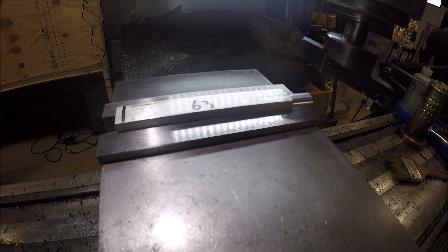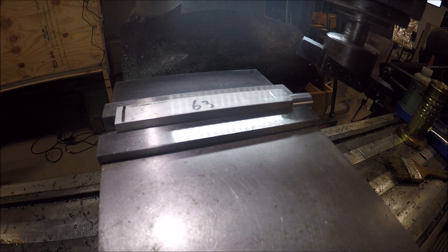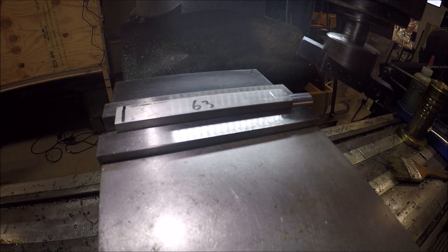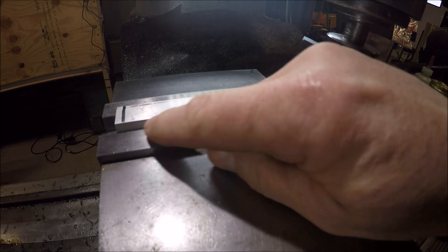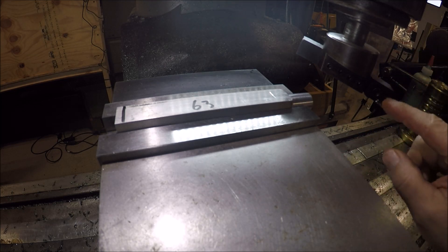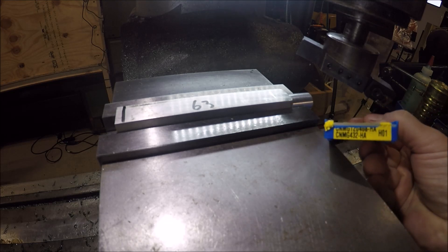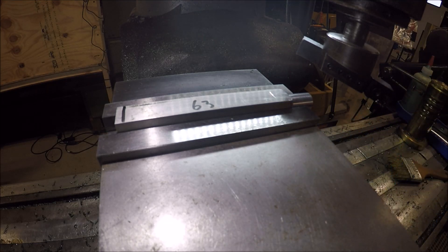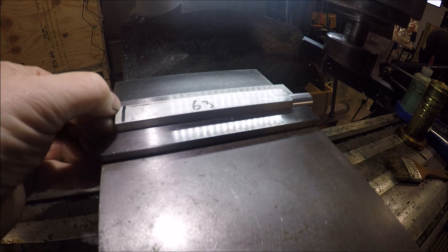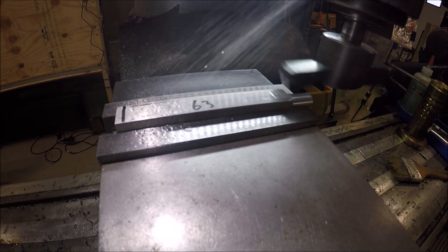Apologies for the noise — I just got down here and it was about 50 degrees, so I've got the kerosene heater running to knock the chill off. I just touched off and I'm going to fly-cut this since I've already got the fly cutter in from a previous job. I've got an aluminum-coated insert in there, so hopefully it'll leave a nice finish. We'll take her all the way down to the mark, leaving the shoulder or fence. Throwing a little WD-40 on her.